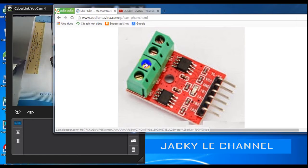The L9110 controller is used to control two motors for a compact-sized robot. The L9110 controller module can handle up to 800 milliamps per motor. The circuit operates on voltages from 2.5 to 12 volts, controlled by a microcontroller with 3.3 and 5 volt logic levels. Engine speed is controlled via PWM, with direction controlled through logic-level signals.